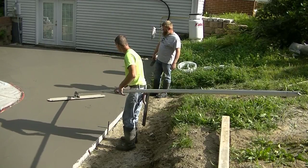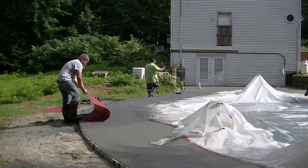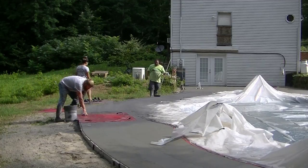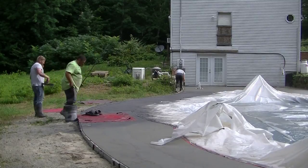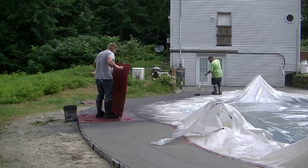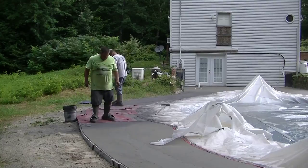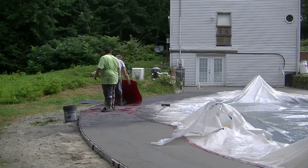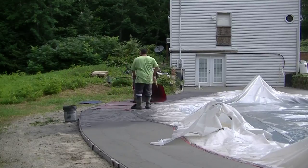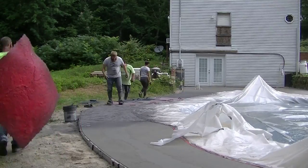After learning and watching videos, you still have to practice on something small just to get the feel of the concrete. That's basically how finishing concrete works — you've got to understand how it feels, whether it's under a mag float or a steel trowel. The concrete's set up enough now so we can start stamping, and this is the key: learning when to start. It's different every day depending on your conditions and the temperature. I've got plenty of videos on learning when to start stamping. Darren and Eric are getting started based on where the sun came up first and where we started pouring.